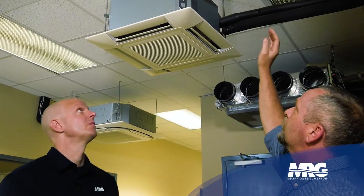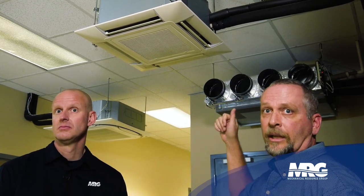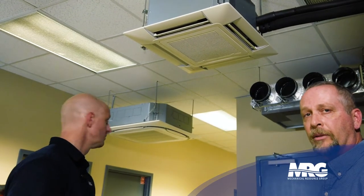Right above the ceiling, what you can't see is I'm pitched down going to gravity drain after that. It depends on what style of indoor unit you have — how high of a vertical lift you can get out of it. This little guy does pretty good; it'll do 21 inches. This unit back here against the wall is an FXMQ ducted unit, also comes with a factory installed pump — you can only do an 18 inch lift on that one. And the FXFQ 3x3 cassette in the corner has probably the best component; it'll do about 24 inches of lift before you need to start pitching your drain down to gravity drain to get the condensate out.